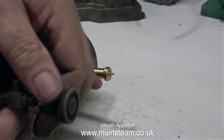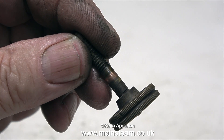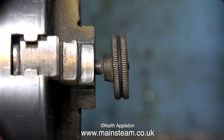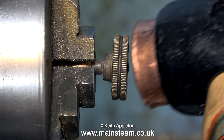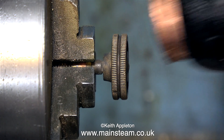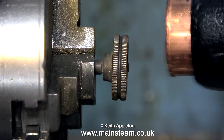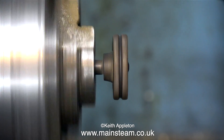Instead I'm going to dismantle the tap — and you can see how wobbly it is. Here's a close-up view; you can see how much off-centre it is. And here's a shot of it in the lathe chuck, and as I rotate the chuck you can see just how wobbly it really is. So I'm going to tap it back into position, but not like this — this obviously does move it, but it's not the best way to do it. Before I do the job properly, here's a health and safety warning.